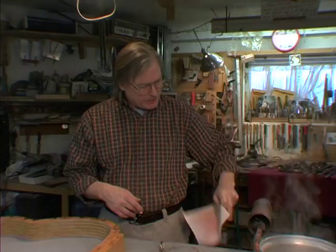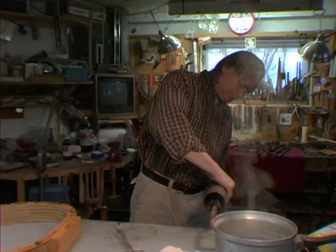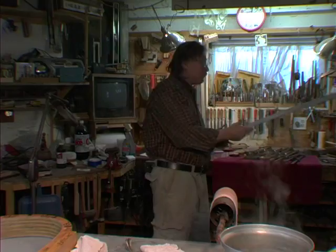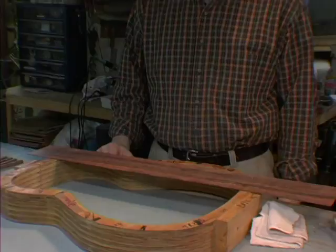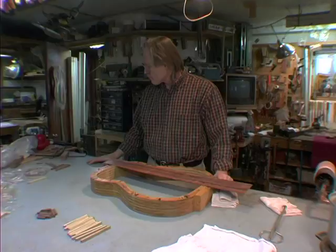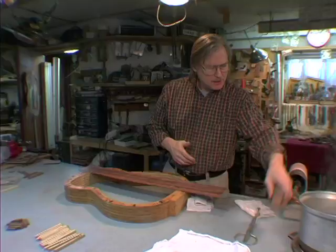I'm going to soak this rag and lay it over this bending iron. I'm going to light this torch here — it's a homemade burner over a piece of brass pipe — and this has probably been used for a thousand guitars. Hopefully we won't crack this wood today, and we're going to bend it right into this form. It's hard to believe that that piece of wood is going in there, but it will, one way or another. We've got clamps ready, we've got rags ready, we've got bending sticks ready. Is there anything you do psychologically to get ready for this?